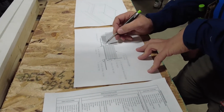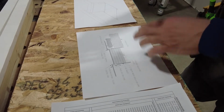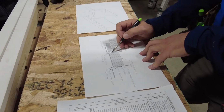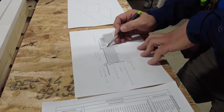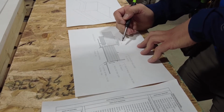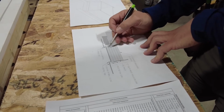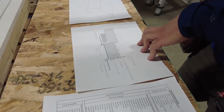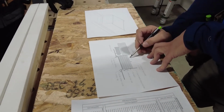So to do that, we need to put a piece of plywood up here. It's called OSB, oriented strand board, chipboard, all glued together. It's more stable than plywood, that's why we use it. And then we use a 2x2 as a nailer. So we fasten it from here to here with a nail, right? And so we have our nailer and we have our dam material, okay? This is heavy, and all this up here, this is the 2-inch pink foam that you use for a substrate when you're at the bottom, when you cut that last piece of OSB.